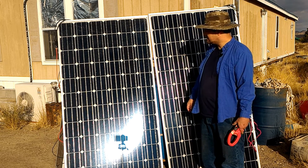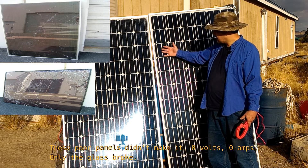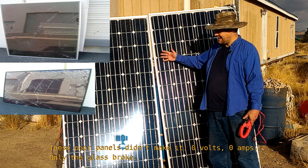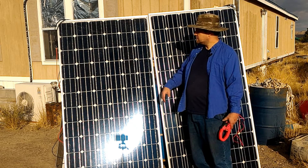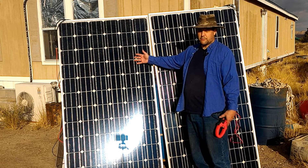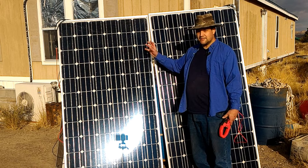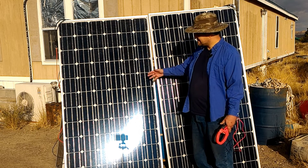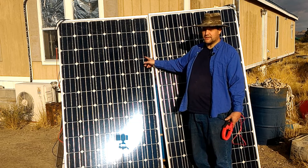Most of the polycrystalline panels and thin film panels I've seen — like Kyocera and such — they're made with a process that literally puts them right on the glass. And when they get smashed, they don't work anymore. So maybe, in terms of preparedness, a monocrystalline panel would be better. This is a point and caveat in the selection of panels that I haven't heard anyone talk about. I think it's an important one to consider.